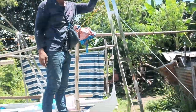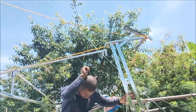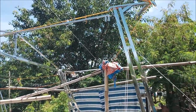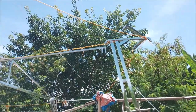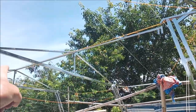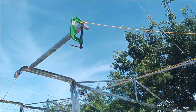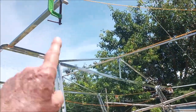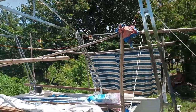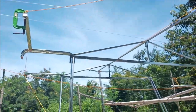Okay. So everybody, can you see that? This is our tarpaulin supports here. That's what we've been working on for a long time. Not done yet. We need to weld a little standstill loop there and one back there. And then this will be done. We got to do some finish work on these little notches for the two to set in. And other than that, then after this, we can put the tarpaulin on and see how to mark it to get it exact fit, and then take it back to the tarpaulin company, and they will cut it to my marks and put the holes in it in the right places and all that stuff.